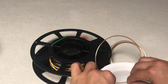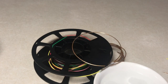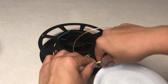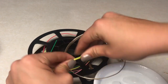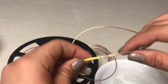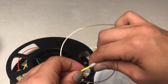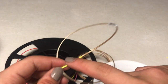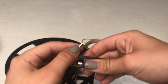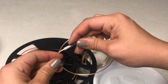After a couple of seconds in the cold water, you might want a paper towel. To remove the fused filament, just twist the PTFE tube to loosen it and pull it out. If it's not fused enough — like here with the gold — push it back and restart. Cut two new pieces; it takes a little practice because it can be hard to tell if they've fully fused.